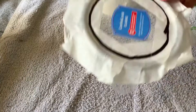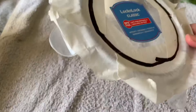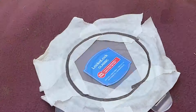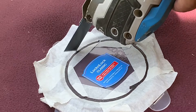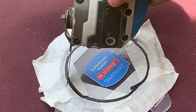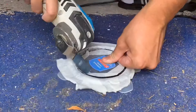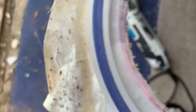We're moving down to the shed. The room is currently 28.5 degrees so I am sweating. Now the best way of cutting: you don't want the blade bending inwards towards the circle — you want it going up and out to the right, constantly going around and not in. Because the blade is vibrating it will naturally go in, so just keep releasing it, putting it back, and going all the way around. Little movements in and around, and once done you should end up with a pretty good-looking circle — rough around the edges, but we'll deal with that next.